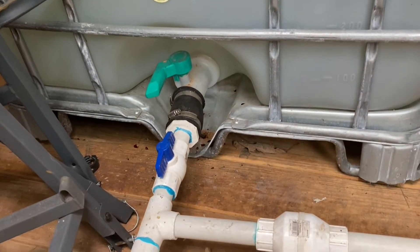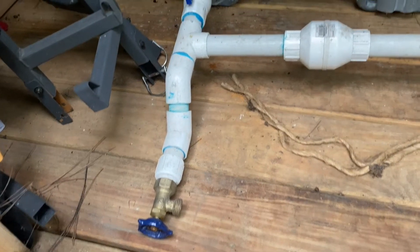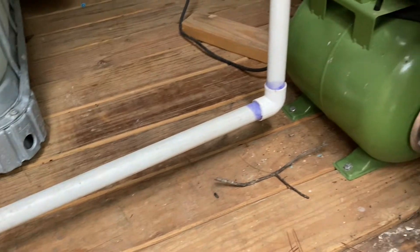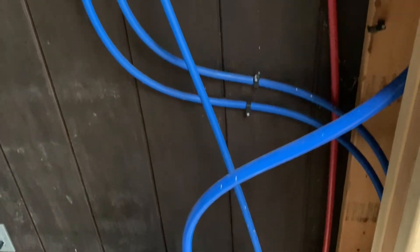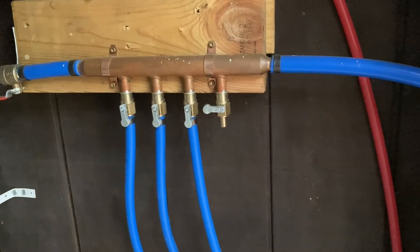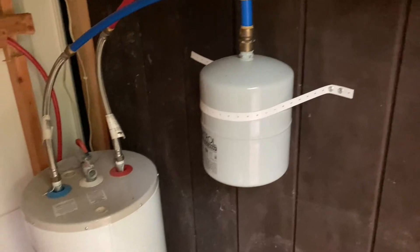The basis of the system is this very large tank that's connected to a shallow well pump via PVC pipe and valves. If you want the detailed build instructions, just check out the link in the description. As the water makes its way through the pump, it then heads to two manifolds — a cold water side and a hot water side. The half inch lines you see here are distributing cold water throughout camp, and then you see a three quarter inch line going through a thermal expansion tank and into an electrical water heater.